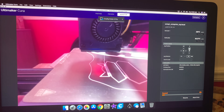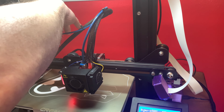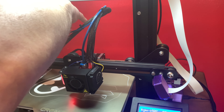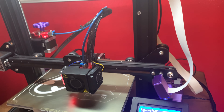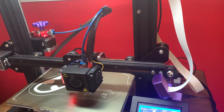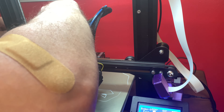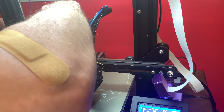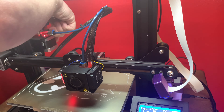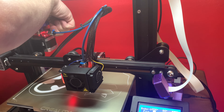Now I'm going to do a really quick filament change. Your stepper motor is going to be locked at this point, so I'm going to pull my lever and just pull my filament right out of my hot end. Then I'll grab a new roll of filament and feed this purple filament right back into my extruder. Remember, your stepper motor is going to be locked, so you will not be able to turn your extruder knob to change your filament. Now we're just going to feed the filament all the way down the tubing to our hot end.